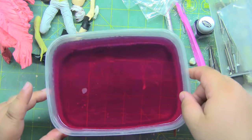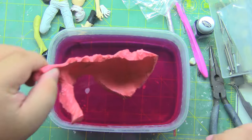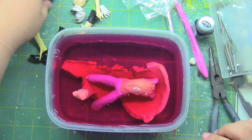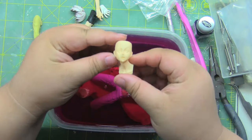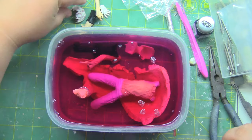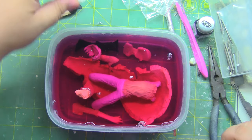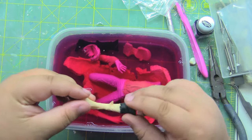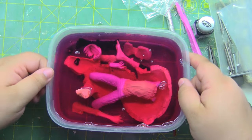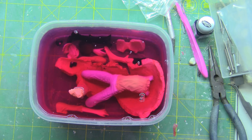First off, you need a good de-greaser to loosen up the paint — not exactly to take it off, but just to soak it enough for you to be able to work with the rest with minor issues. I use Purple Power; you can also use Simple Green, although I wouldn't recommend OxyClean because it doesn't have the same effect for some reason. So you take your pieces and dunk them in a bath of Purple Power. Now Purple Power is concentrated, so you have to choose to use it straight from the container or mix it one-to-one with water. The difference is that straight you will only need one or two days of soaking, contrary to the mix ratio where you will need to leave it for at least two to three days.